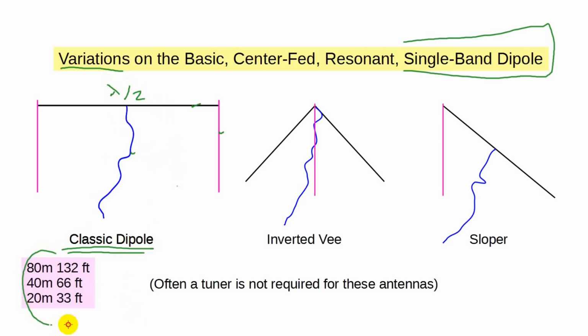The proper height of a dipole is a half wavelength in the air, which means 2 tall supports, very tall in the case of the lower bands. It's unrealistic to expect to get your dipole a full half wavelength in the air. Even on 40 meters, this means over 60 feet. In almost every case, the dipole will be mounted well below this.